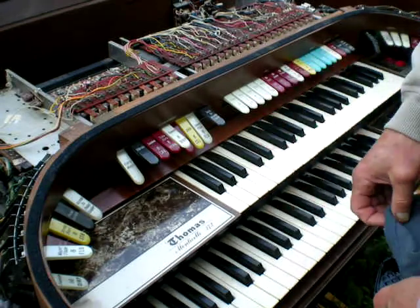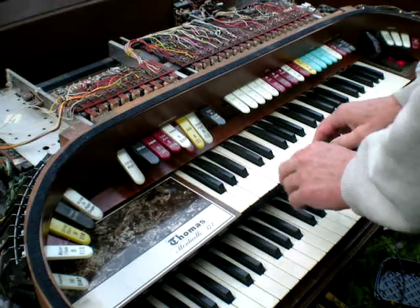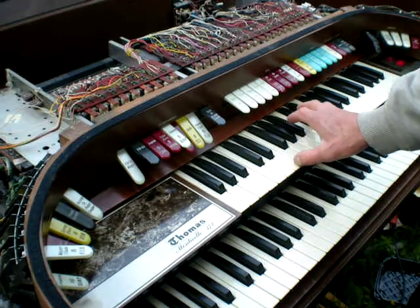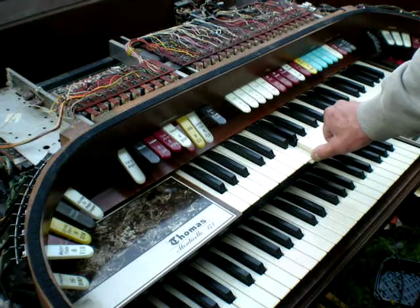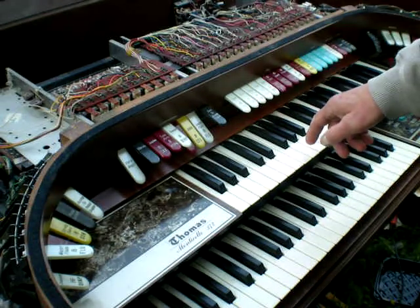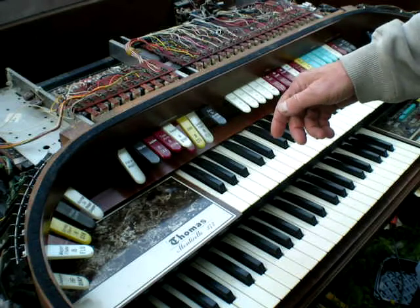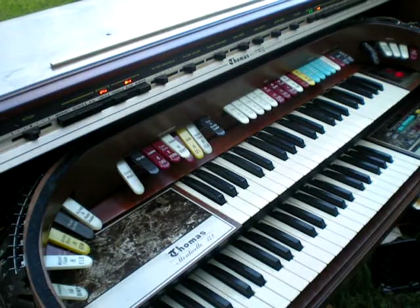Initially when I hit it, it was remembering some previous state and wasn't tracking right. It's got a nice octave there, but it'll do that on any note — it gradually sags down to where it's supposed to be. So there is a leak. If you test the key voltages themselves, they're all okay. It's happening after that, in the sample and hold after the CA 3080 that is the first stage in the sample-and-hold circuit. There was a switch contact that was hanging on one of the bars, so I think it's good now.